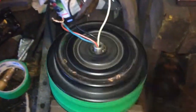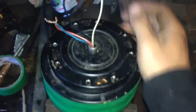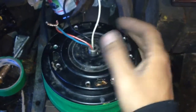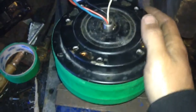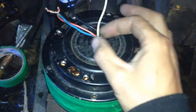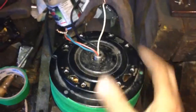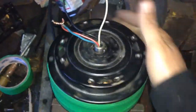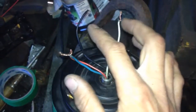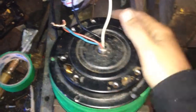When I put it on the bicycle it was pretty hard to manage because I'm clumsy and I'm trying to hold the wires, hold the motor, pedal, and read the voltage — but I was getting 80 volts just pedaling easy. I'm thinking if I can mount it and maybe pedal harder I could probably produce 100 volts with this thing. I'm not going to use it for making AC — it is making AC and putting out close to 100 volts AC, which is like your household power — but I'm going to rectify it into 12 volts DC and use it to charge a battery bank.